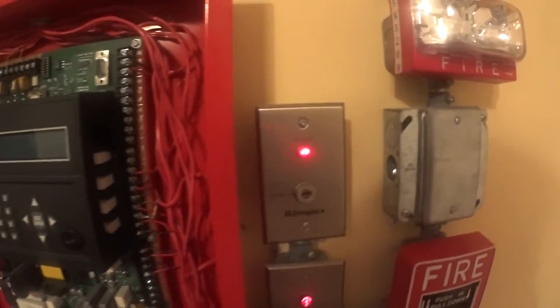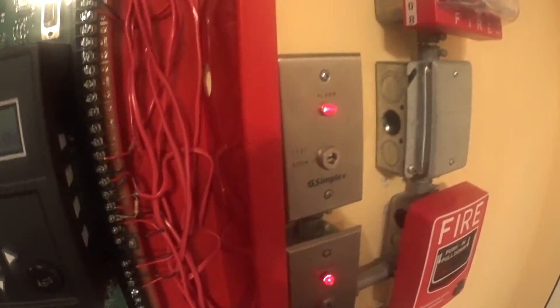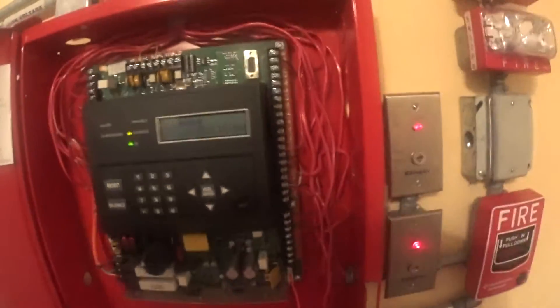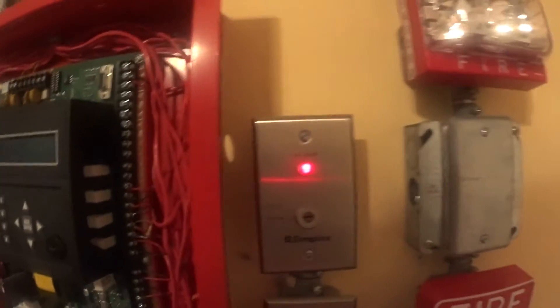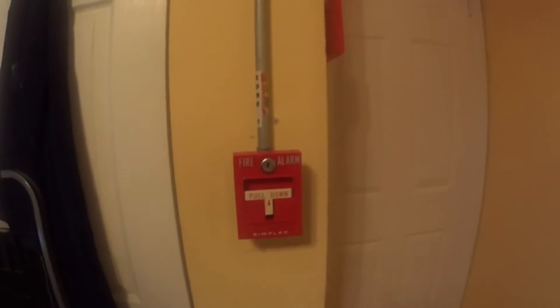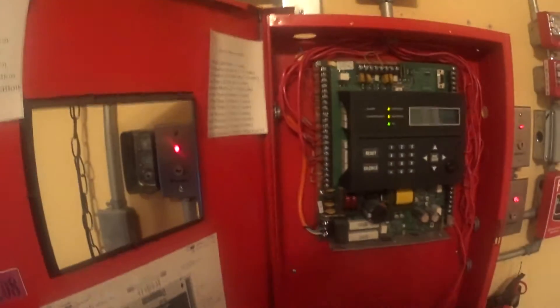The Simplex key station is the top one — that's not fully wired in with the panel correctly yet. And the next pull station is the entrance pull station for zone 8, which is the very last wire. This one here — you follow the conduit, it goes to this: the 4251-20. And back at the panel, that's all the wiring for the zones.